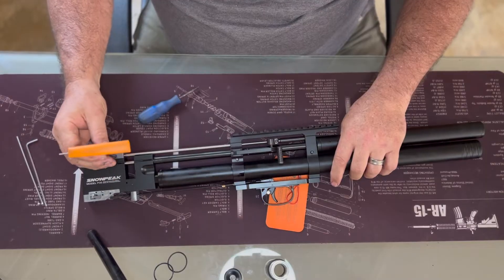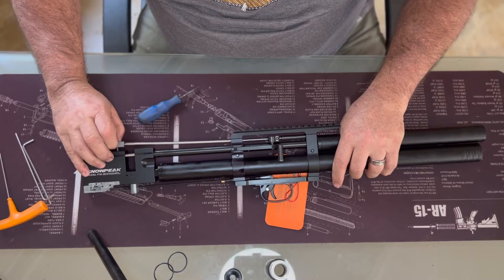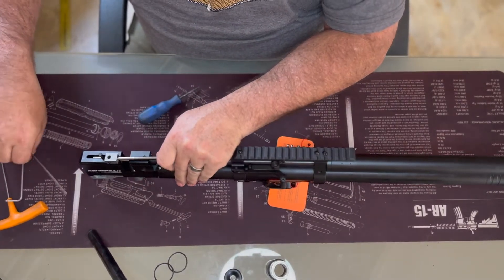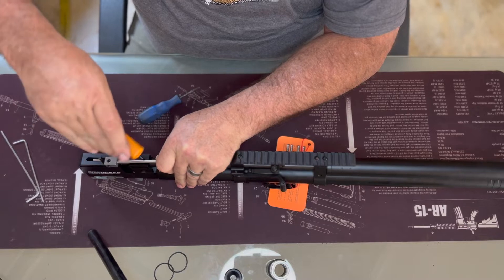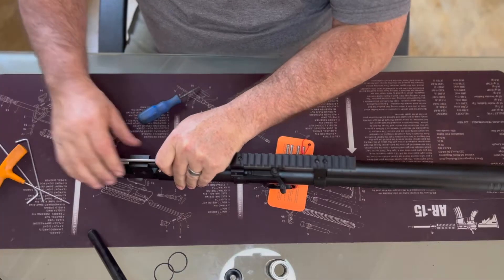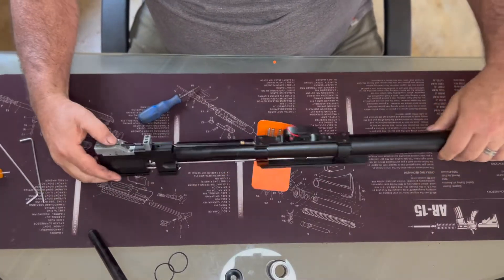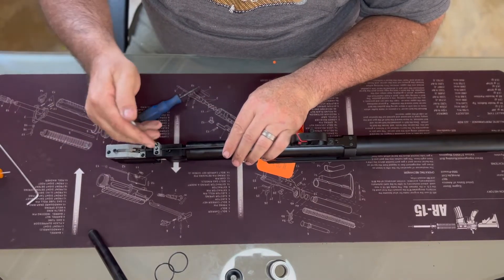Loosen up your cocking lever - we're going to turn it away a little bit. Then we will undo the muzzle, for your barrel, and remove your barrel to one side. In the meantime while it's still emptying, once this is loose we'll take out the grub screws on the trigger and on the support here.